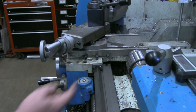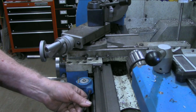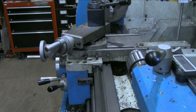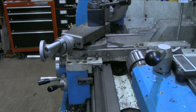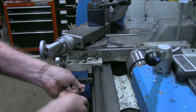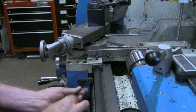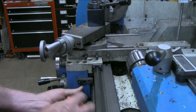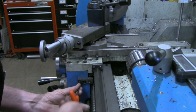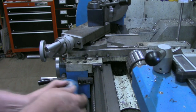So what I did was make a modification to the lathe. First thing I want to do right here is take the thread dial off and set that to the side. This is the mounting bracket for the thread dial — we're going to take that off too. These are five millimeter by 0.8 pitch socket head cap screws holding it on. Before I take that off, I want to take one quick measurement.